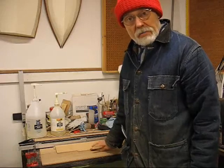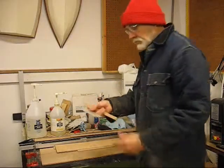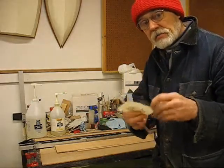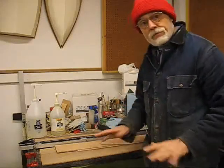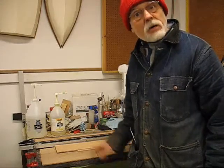Let me go ahead and start lathering some of this stuff and we'll get back to it. This will be another one of those thick coats spread out with the small-teeth trowel. Because once you have nice even furrows along there, there's more than enough there to spread out, soak into the wood, and then leave you a bond between layers.